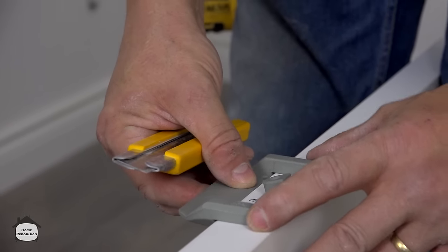Now we're happy with our locations and we're going to get the rest of the screws installed. For the hardware — I'm going to install it now even though we haven't painted; I'll take it off to paint later. We have two doors and on each door they're going to get a door handle. On one side we put in the latch, and on the other side the catch. In the top of the door jamb, we're going to install these roller ball units. Inside the top of the door, we drill a hole and set this in compression-wise — it's just a ball, and when the door closes it'll catch and keep the door in position. So each door will be held in position with that assembly at the top, and in the middle it'll be latched together to keep it in position long term.